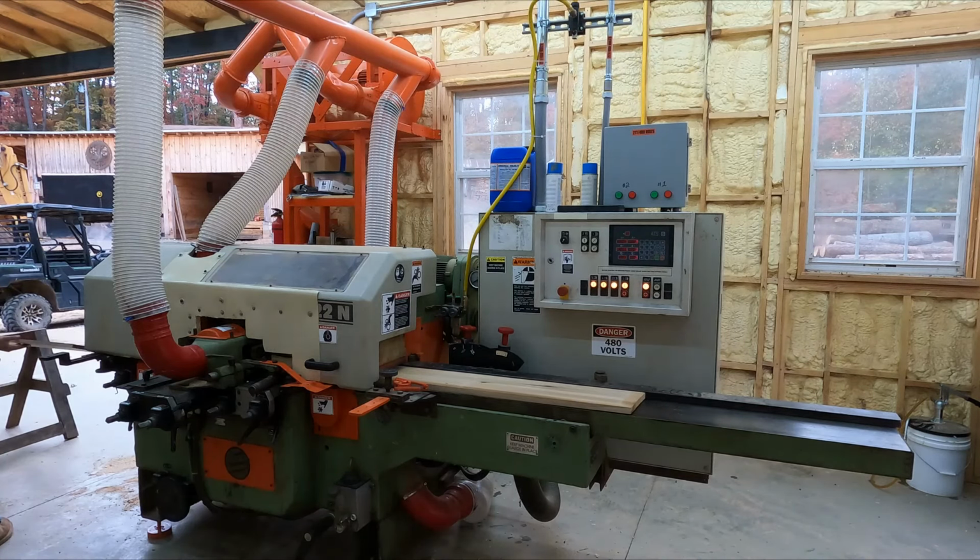One thing I'm learning real quick is we may need to start cutting our boards just a wee bit thicker. We have been, actually. We've cut them a lot thicker. Yeah, these we cut a long time ago, but if you're cutting on a Wood-Mizer at 1 inch and it dries up to 15/16ths or less, you're just barely gonna have enough to two side clear.